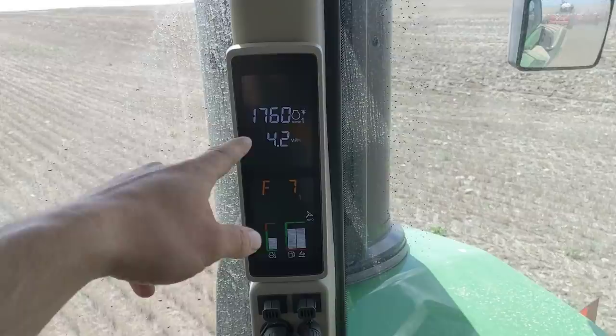And for some reason, you can even have it at 1700 RPM, or even 1400 RPM, and it will still rev itself to 2200 RPM to make the shift, for absolutely no reason. You can have the drill out of the ground. I'm not making this up. It's bad. I don't know how you guys grain cart with these things. You can't grain cart with this tractor. It cannot be done. So for the guys who are trying to do it, my hat's off.